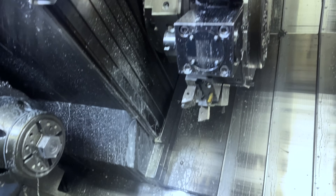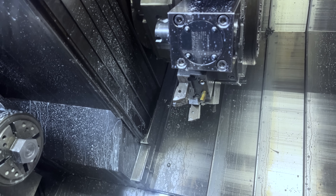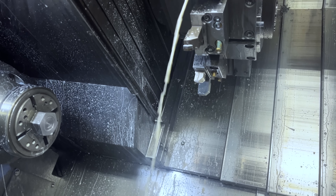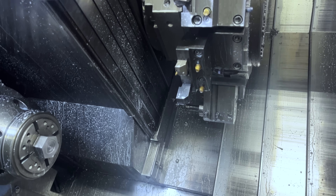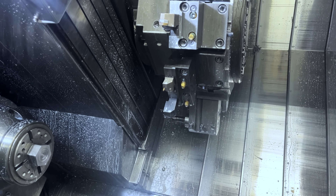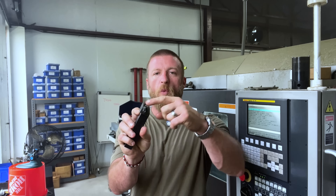It's a common mistake I see people make — they think as long as it's wet, it's good. Sometimes that's true. Adding a little bit of coolant could help, but we want to flood that cutting edge. That's your coolant delivery: coolant through the drill, and for your turning insert, you want your coolant directed right at the cutting edge. It's a free fix.